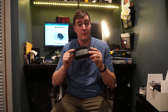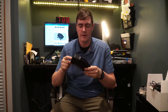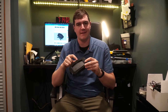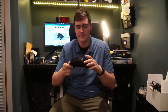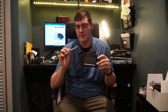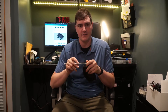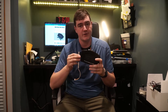I've already worked out the mounting for the backup camera screen. I'll disassemble it here on camera so you can see how I've put it together, but the next step for me is to solder in all 16 LEDs and the associated connectors. Unfortunately, because this was designed for a different style of LED, the LED spacing here does not match the pitch of the LED strip, so I'll actually have to cut each LED out and solder it with hookup wire, glued into each position.